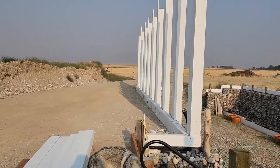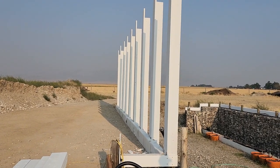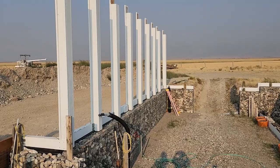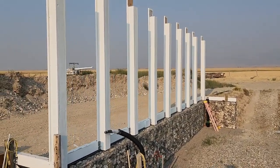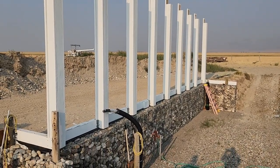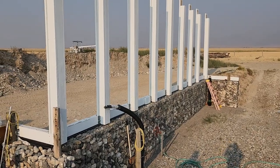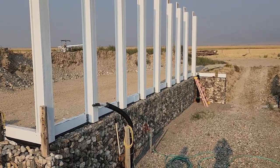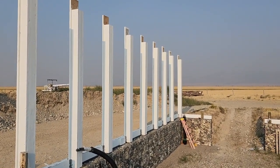You can see the columns we put together. We're going to be putting together a roof structure on top of those nine columns. Another look at the columns from on top of the root cellar — you can see the construction. Those were posts that came up into the wall right there — gabion baskets. We put 10 to 12-foot high posts in the ground and then built those baskets around them.